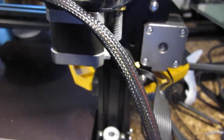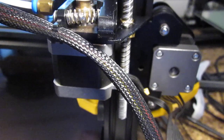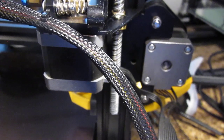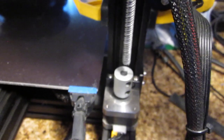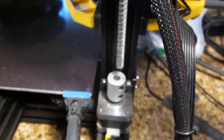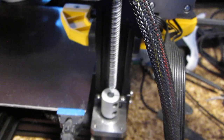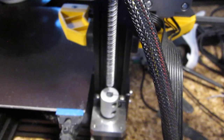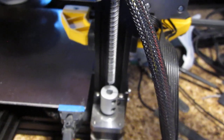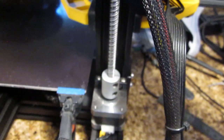When I build a printer, I know I'm feeling it — I can feel it left and right, right there. That should fall directly into the coupler. Because I'm just moving it, I can feel resistance there, back and forth. Find the center, locate the center — you can feel right there is no binding. Technically, with no binding, that should fall straight in, as it does, as you see there.